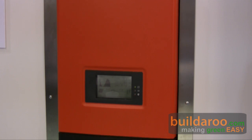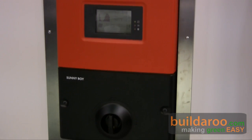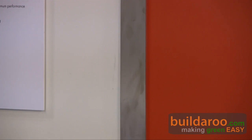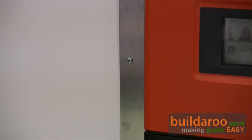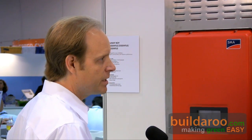This can actually mount in the wall in new construction. In new housing divisions, they ask for a solar option to be made available to homeowners. What this allows installers to do is go in during the normal electrical rough-in stage of construction, mount these pans in the walls, pre-wire their wires into these areas, and leave them there. Then if the homeowners choose to have solar installed, they can drop these in and everything's ready to go — a huge advantage for installers.